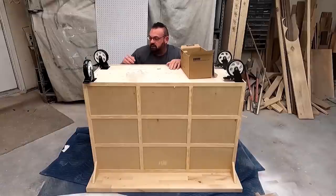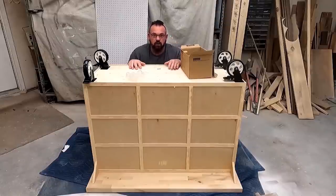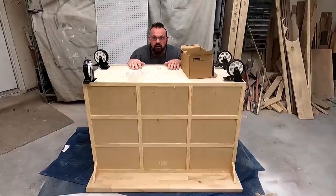And the second reason is, since we're not adding any height, because we're doing 36, 37 inch countertop height, you want to stick, whenever you're building stuff like this, if it's going to have a seating area, like the lip on this one, to either tabletop height, countertop height, or bar height, because it'll make it more convenient for your customers to find bar stools, because they sell bar stools for tabletop height, countertop height tables, and bar top height tables. So if you get into a weird funky size, they're gonna have a hard time finding a bar stool that fits their piece just right.